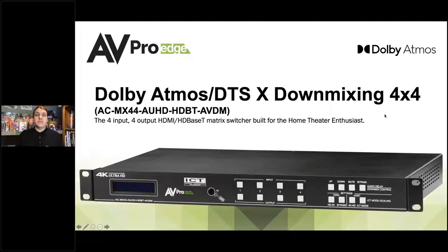At the same time as we're getting Dolby Vision throughout our eyes, we're hearing Dolby Atmos in our theater, and we are able to convert those signals so we can see them on maybe a 1080p display instead of a 4K display, a display that doesn't have HDR or doesn't do Dolby Vision, throughout a home that needs to maybe have a patio, garage, kitchen or living room zone that's only going to have two channel audio, so it doesn't support 30 channels. Well, this switch can manage all of those features at the same time, built inside.